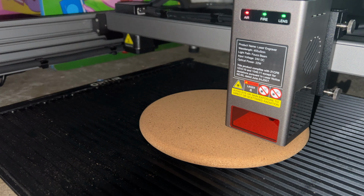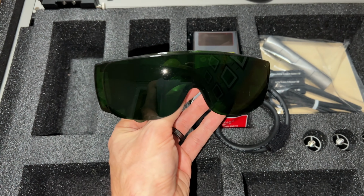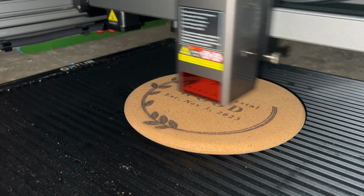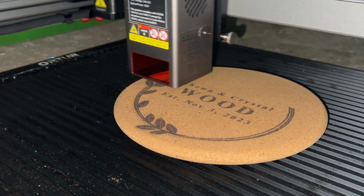Adjust the workpiece or the design incrementally until the two coincide. Put laser safety glasses on. Ensure nobody else is in the room. Hit run and hope for the best. Inspect the workpiece to determine if the design was placed as intended. More often than not, it isn't.